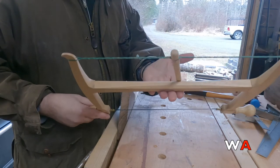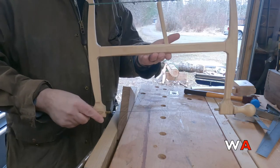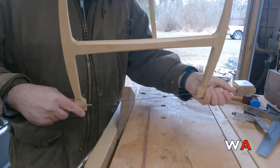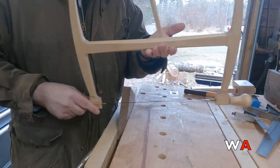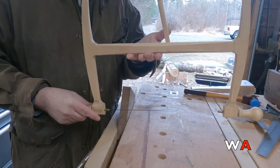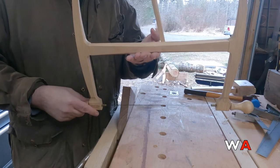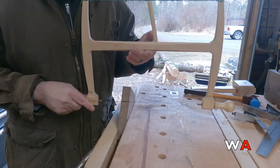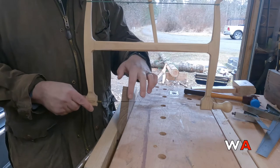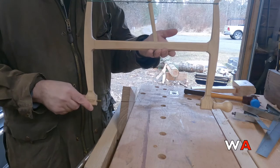As you raise and lower the left hand, it changes the angle of the blade so you're not struggling against yourself and getting wobbles. The blade is just going to go neatly back and forth, held in place by the left hand, which is just holding the weight of the saw at the right angle.